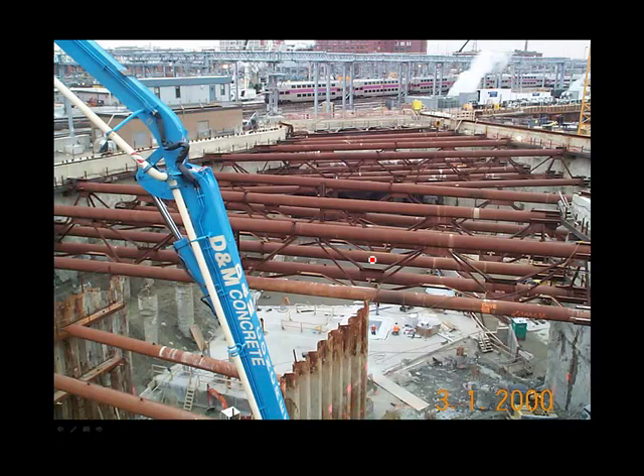The purpose of this excavation was to construct concrete sections of a tunnel, and the sections were individually jacked underneath this railroad, so there was absolutely no interruption to service on this very busy commuter railroad. In order to create these concrete box sections and move them around and jack them, you needed a completely unobstructed workspace — a huge open space free of any kind of bracing at all.